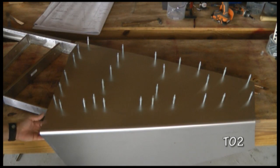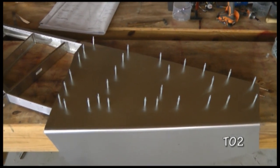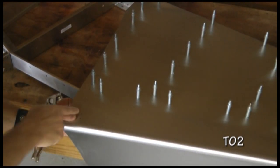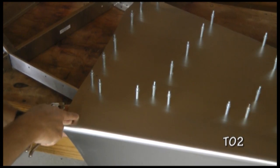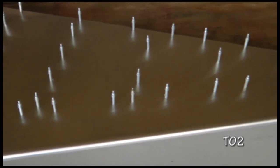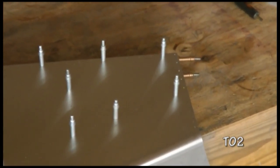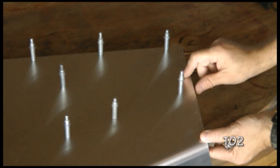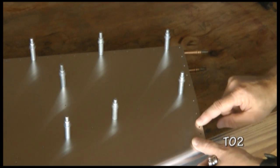Now we have to adjust our rib underneath here, looking for the line we drew on the center of the flange. And when we see that center, we'll go ahead and use the pre-drilled holes in the skin to go into the center of the flange and then cleco as we go. And similarly, at the other end, we have our other rib. And likewise, we need to use these pilot holes to fill in these holes which aren't in the rib at this time, holding the rib nice and even with the top edge of the skin. And we're going to do all this with the number 40 drill and cleco as we go.